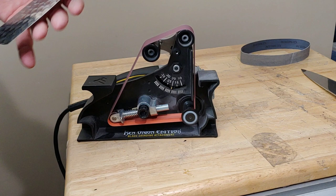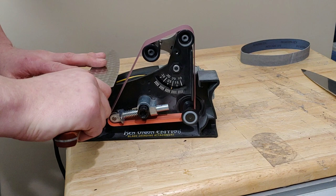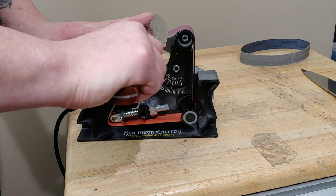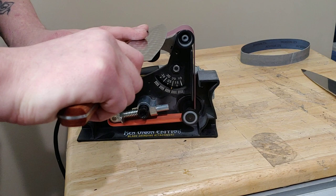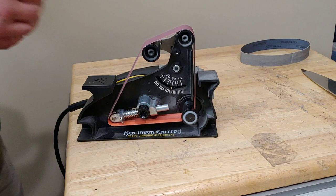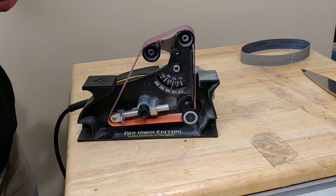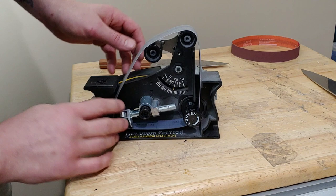A lot of people do a couple swipes and flip; some people do one swipe and flip — I've done it that way too, but finishing one side at a time gets me the best results. You never want to watch how fast somebody else did something and base it on how long it's going to take you. That can be a huge mistake — you'll start thinking it took them 10 minutes so it shouldn't take you longer than 15, and then you rush and get aggravated. Don't do that. Every steel is different, every blade is different — thicknesses, damage, pressure. Just follow the grit and follow the burr.